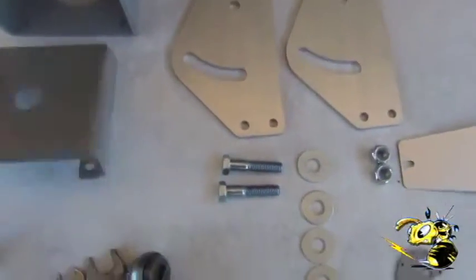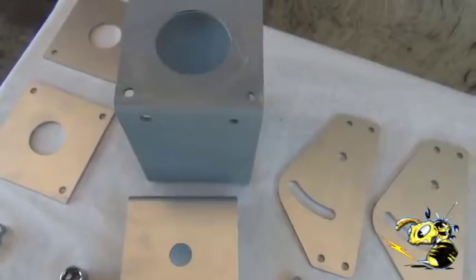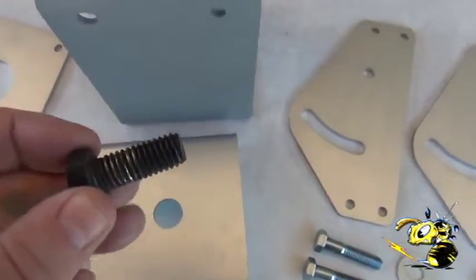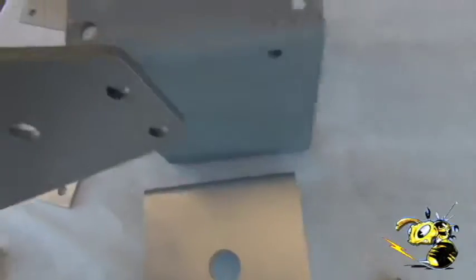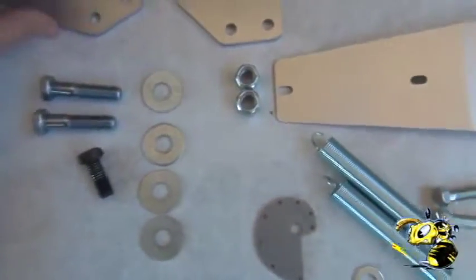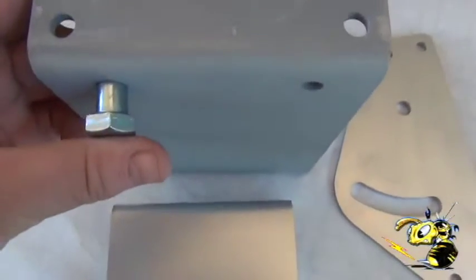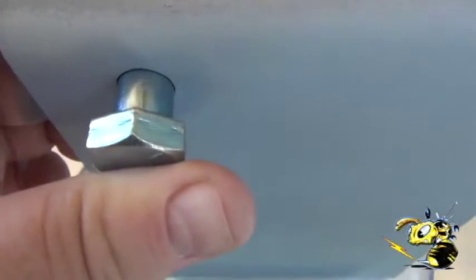It has a split here, but when we put the top cap on it, it will become monolithic. On the first video I made, I used a bolt which is threaded right down to the base — that was causing a terrible squeaky sound because threads are completely damaged when used on a moving part. You're not supposed to have threads on a part that moves. So what we use is a bolt like this which is solid. You put a little grease on there — there's no squeaking sound, and it is a tight fit.